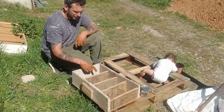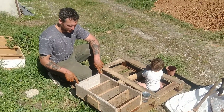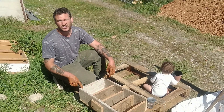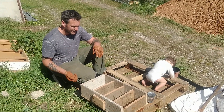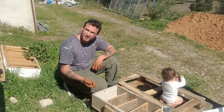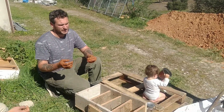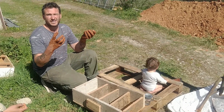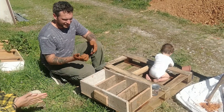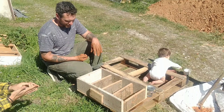You fill the mold almost to the top. The point of this test is to see how much the block shrinks when it's dry. These are 30 centimeters. You need to see what percentage it has shrunk by when it's completely dry after one or two weeks. If there are lots of cracks going across, it could be too much clay. The clay is what holds the water, so if you have lots of clay it holds lots of water, and when it dries all the water leaves and they leave cracks. But you need the clay to stick it to the wall and hold it, so you need to find that perfect balance.